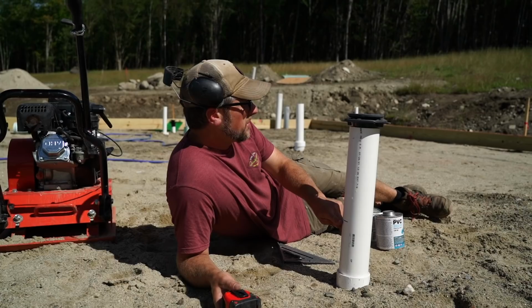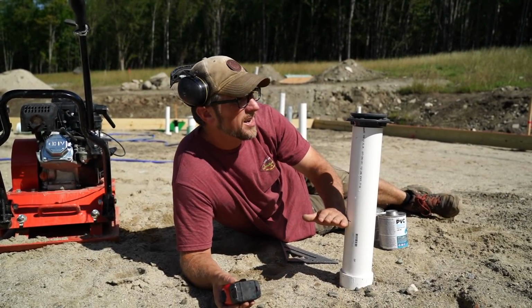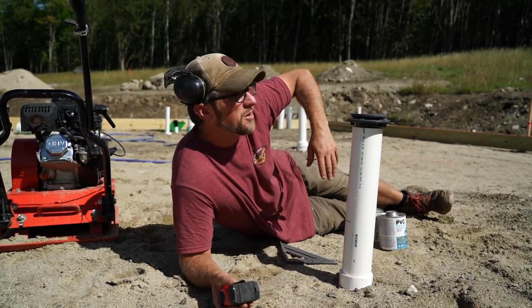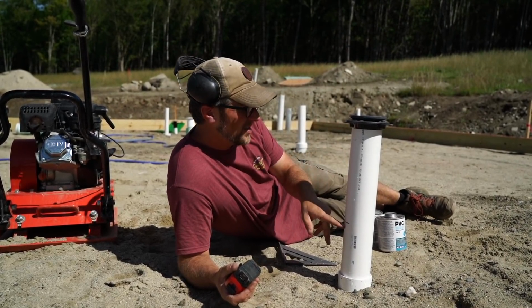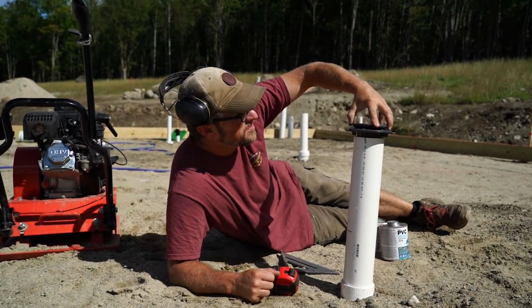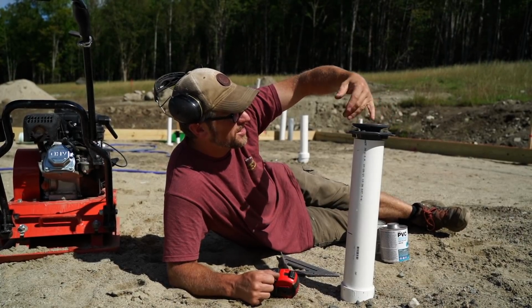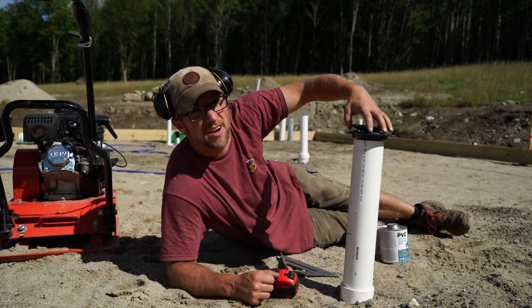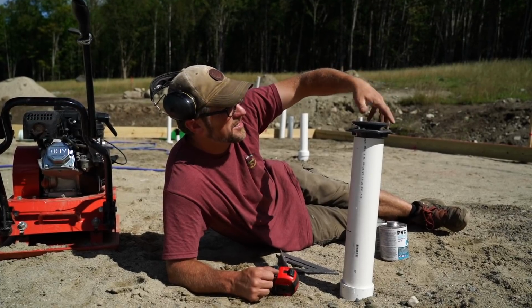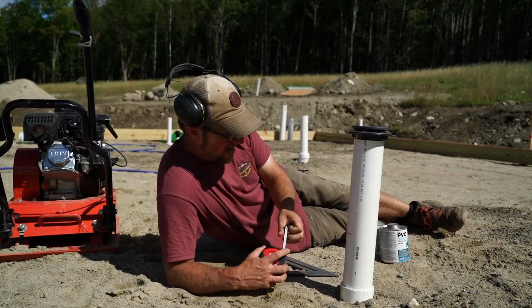If we're 1 inch below here, we could taper everything in 1/8 inch at a time down to here, and then if we need the drain, that'd work. If I go 1 inch. And the nice thing about this drain is, if I decide that's too much, before we pour the concrete, I can adjust this up to a different height. So if I mess up and cut off too much, I can raise more drain up. So I want to go 1.5 inches.